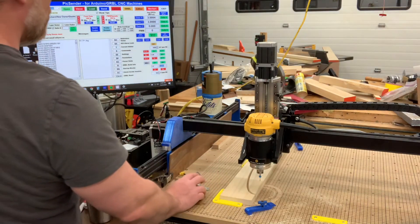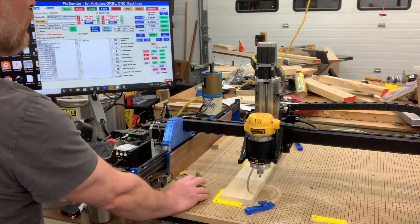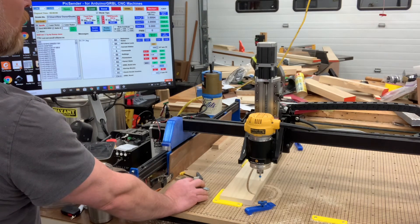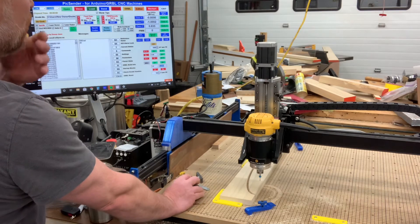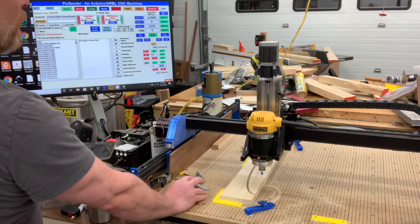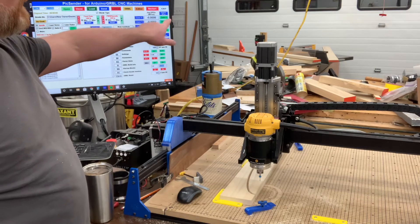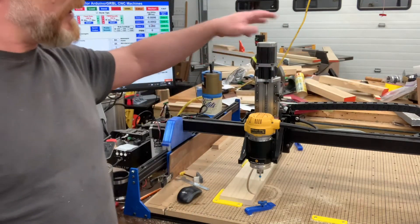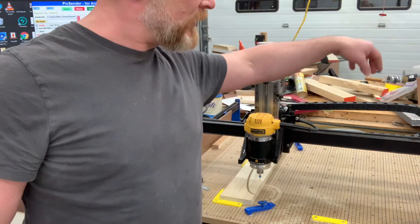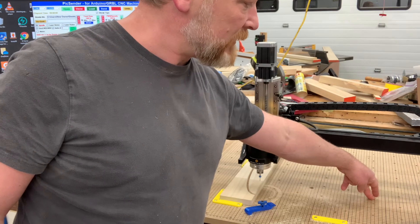I've got the piece over here and I want this to be a new work home. What I'll do is zero out my X and Y under G54. G58 is something I had in there before, so I'll go back to G54 for this new piece. I'll zero that one out. Whatever position it's sitting at on the board including the Z, you zero it, and that zero location is saved under that G number. So G59 — if I put it right here and zero it all out under G59.